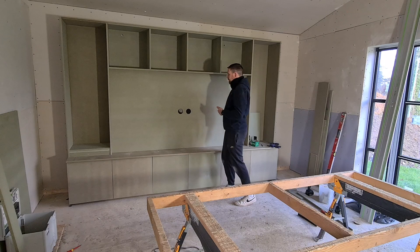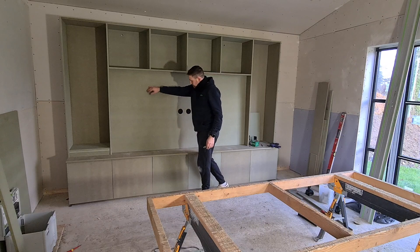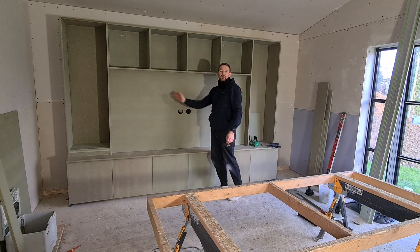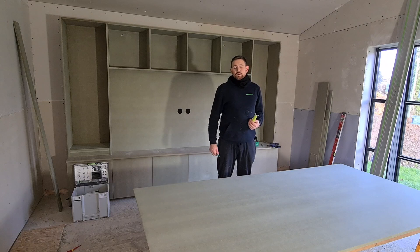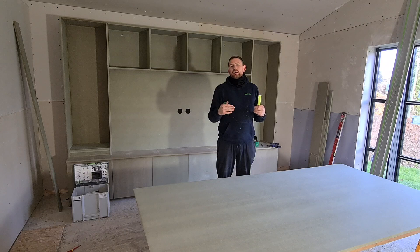So now what we want to do is take the TV size and take 200mm off of that, because we're going to plant another board onto the front of this one which will act as a rebate for the light strip to go around. We just want to cut 200mm smaller than the telly — height and width. So our telly size is 1230 by 700, so we take 4 inches off all the way around — 200mm total off the width and height — giving us 1030 by 500.